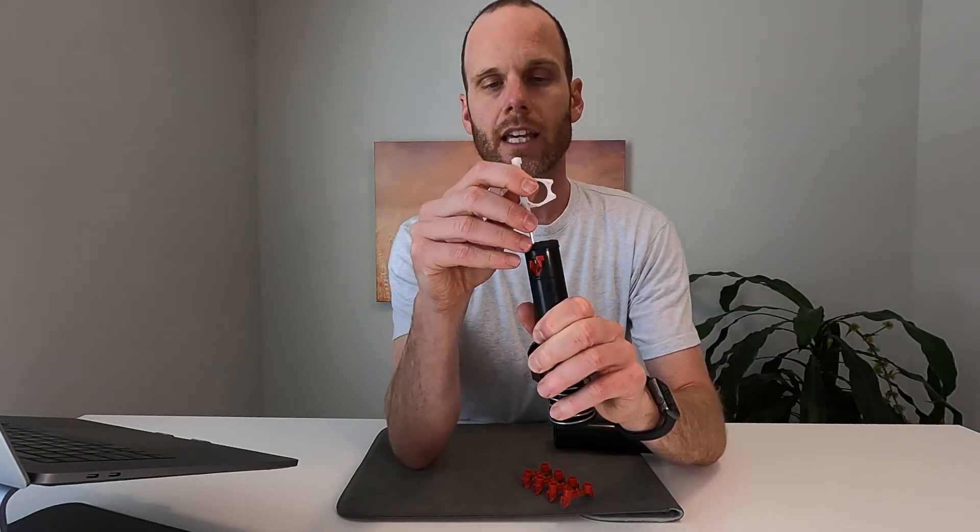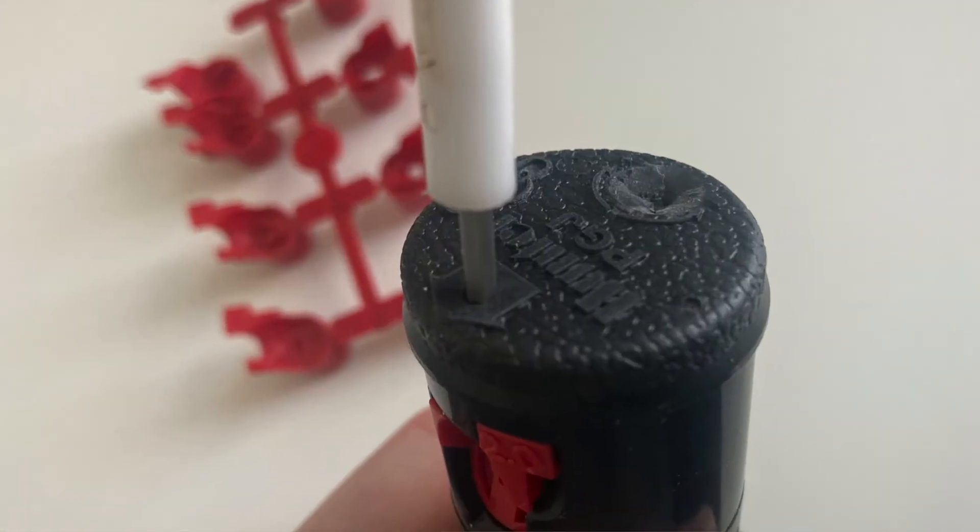With that said, let's say we need 4 gallons per minute — we're going to be covering 34 feet, and to get good watering to that larger area we need to upgrade to the 4.0 nozzle. So here's how we're going to remove the existing nozzle. Using the slot with the arrow, we'll put the hexagon end of the adjustment tool down in there.